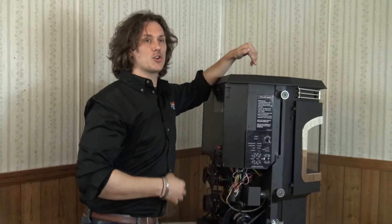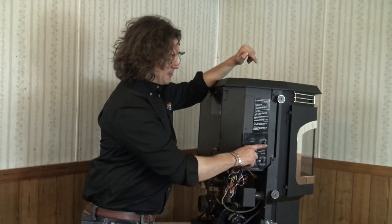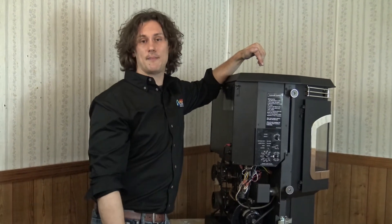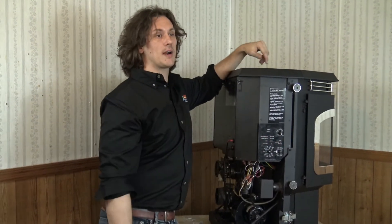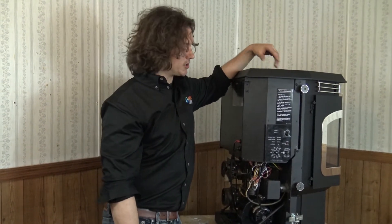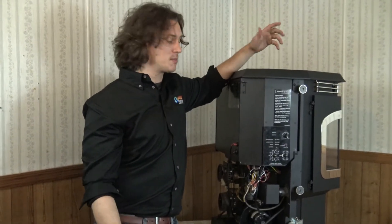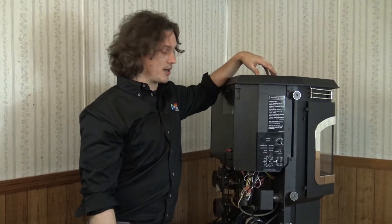In the middle of the season when it's always cold, a lot of people will flip this toggle switch to manual once the stove lights. On manual mode it'll basically allow the stove to throttle all the way down to that small pilot fire, but it holds that fire there, and when the house does call for heat it can quickly ramp itself up and keep that temperature wherever you have it set on the control board. Manual is a great option for houses that are older, draftier, or bigger — they're always going to be calling for heat in the winter. For brand new construction or just heating a small room, we generally want to keep this on auto and allow the unit to shut on and off as the area calls for heat.